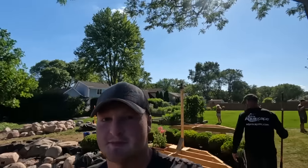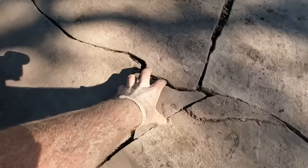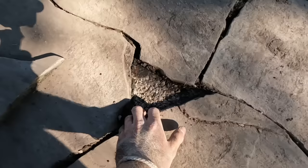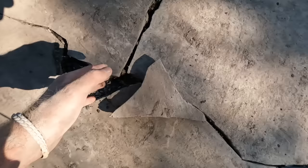One of the tricks of doing these pavers is using cardboard. With these big pavers, it's hard to get anything in there to see what kind of shape or size you need. So what we do is pull each of these up a little bit and shim cardboard under there, then come out with either our utility knife, exacto blade, or just simply a pencil. Trace that out, lift them back out, come back, then just grind it out.